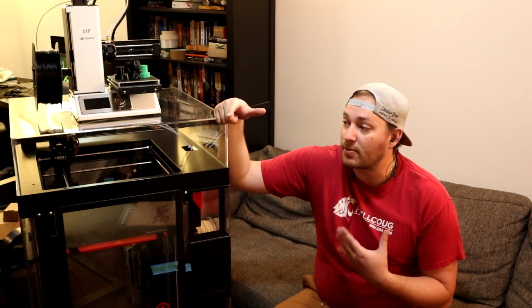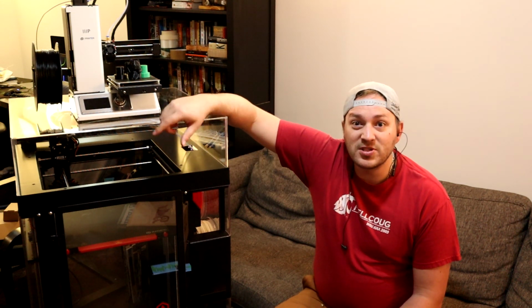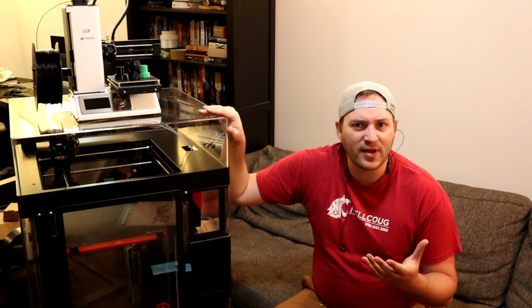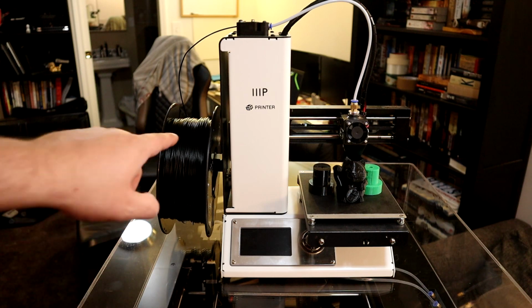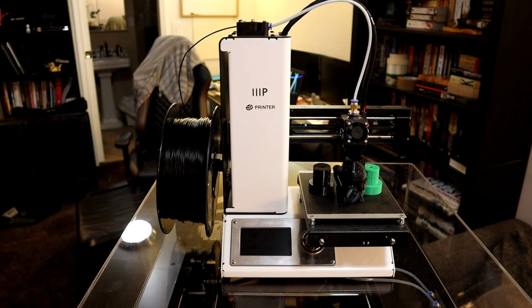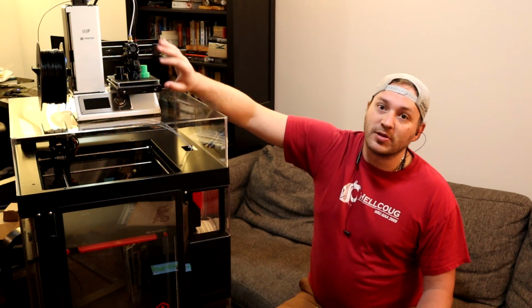But there are some main types that you'll probably see in your home garage. One of the most common types you'll see and probably use, to be honest, even in my old engineering job we only really used one style of 3D printing, is called fused deposition modeling, which is the old Stratasys patent term. You'll also see it as fused filament fabrication. It's a machine that takes plastic from a filament roll, like this thing over here, runs it into a head that has an end that melts that plastic, and deposits it on a build plate. So that's this thing down here. And this head will move around, controlled by a computer file that is run in the machine.